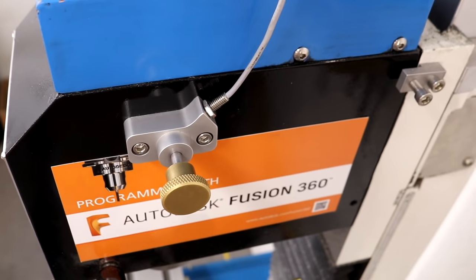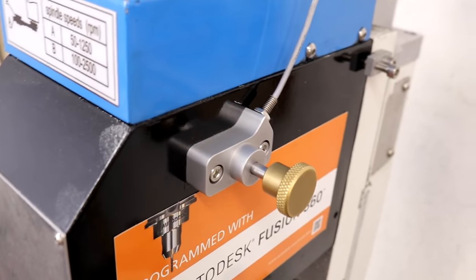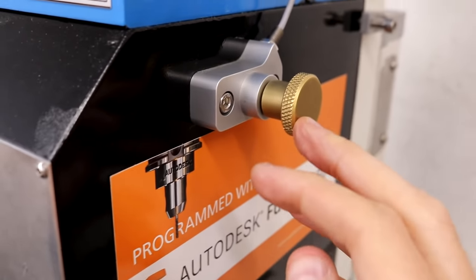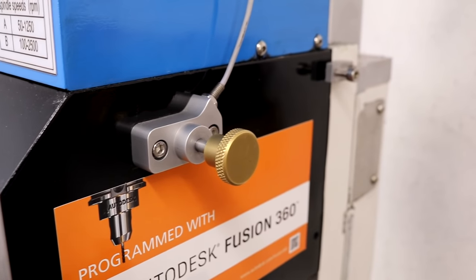I don't have video showing the assembly of the new spindle lock, but I think you get the idea. Like I said earlier, just be careful with setting the preload on the plunger switch. You don't want it so tight that vibration sets it off or its life is shortened.